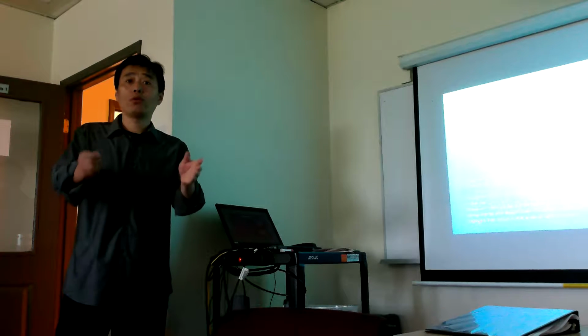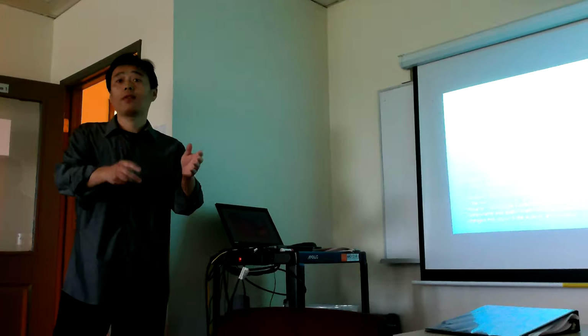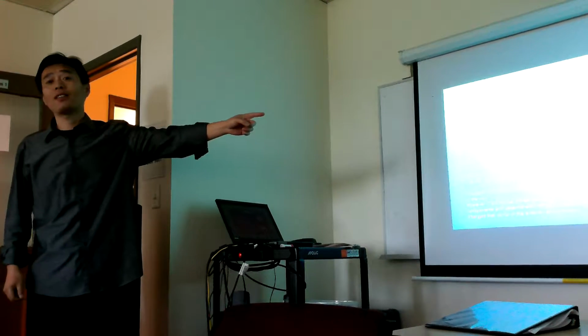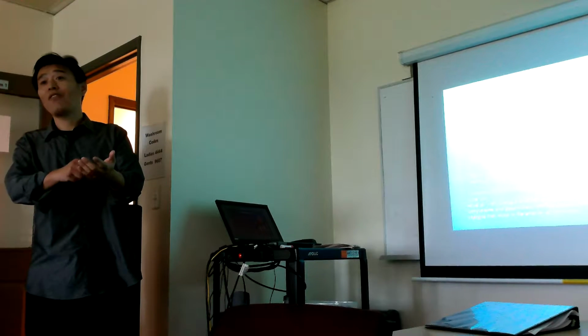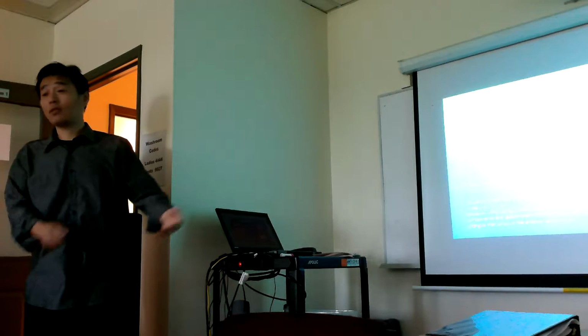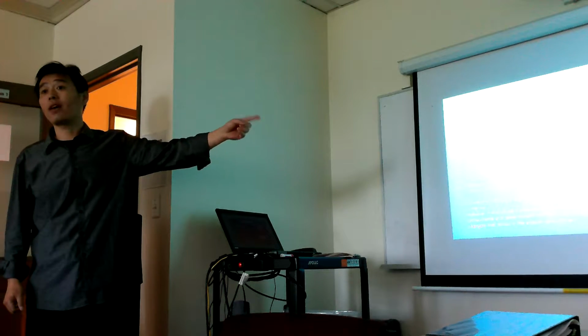If the wall has no insulation, the total R value is about 4 or 5. If you put this one in, it's 11 plus 5, which is 16. So it's a big difference, I think. You need to pay attention to this.